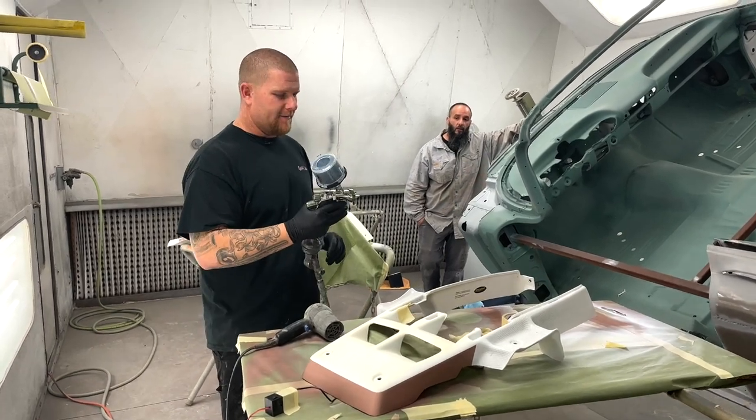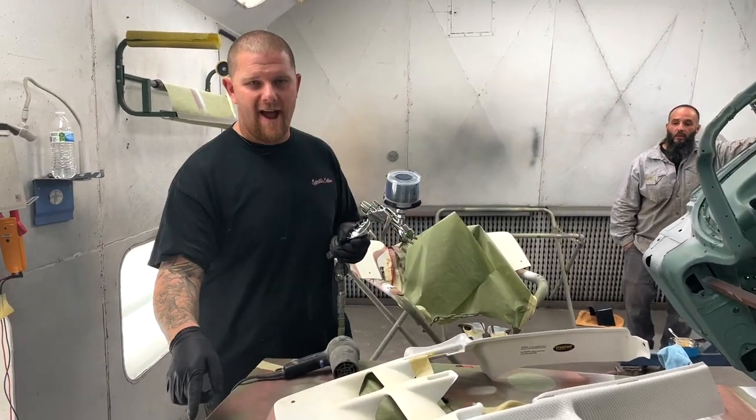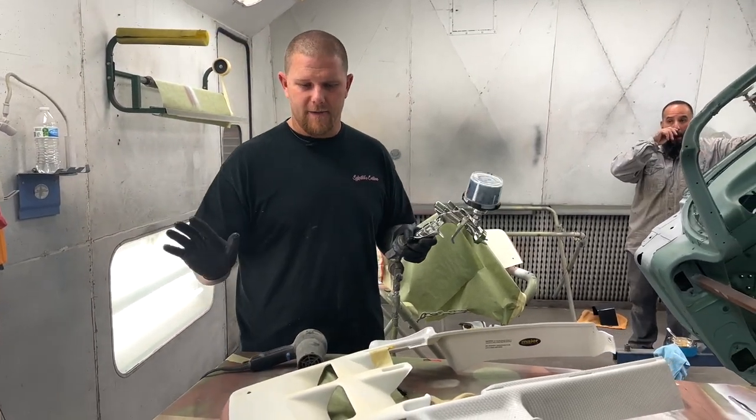All the materials used — out of the four products, one of them you use twice. The only one that's water based is the conductive top coat; all the rest are solvent based. Just things to think about — if you've sprayed solvent paint versus waterborne you notice how differently it sprays. We've already set up our gun and we're just going to put on a real light coat.